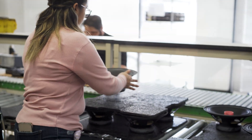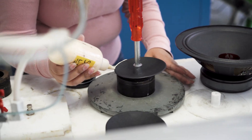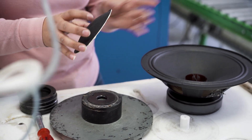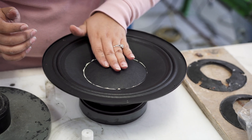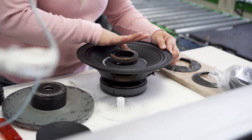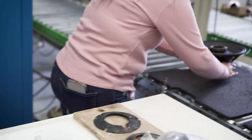When the wiring is done, the speakers go back on the conveyor — all that work is done by hand — and they go down to the dust cap assembly station. There's a robot there, though sometimes it's done by hand depending on the speaker. That dust cap has to be glued into position precisely so it's in the center of the cone. That's a pretty quick process, and it is the only gluing process that has to cure overnight. All of our other adhesives cure in a matter of minutes, if not seconds in some cases. So when we start building speakers in the morning, they end up at the dust cap assembly station in the afternoon.